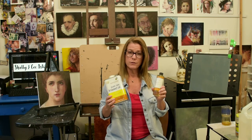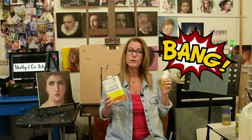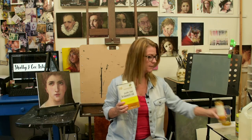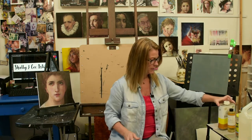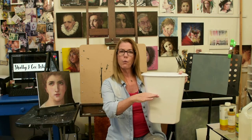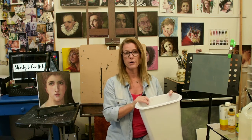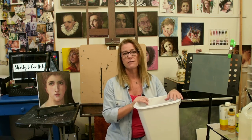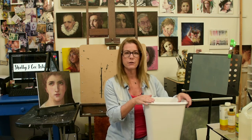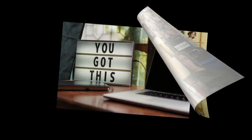There's something very important you need to know about walnut oil and these mediums: the rags you use them on, when put into a garbage can, can spontaneously combust. What I recommend is a small garbage can filled partway with water. When you're finished with a rag or paper towel, throw it into the bucket with the water. At the end of the day, dump it into a regular trash bag and take it to your outside trash.